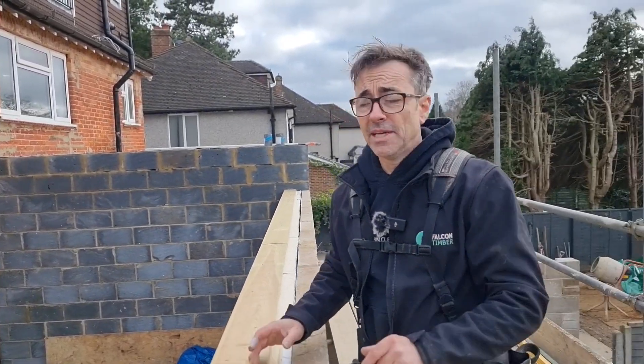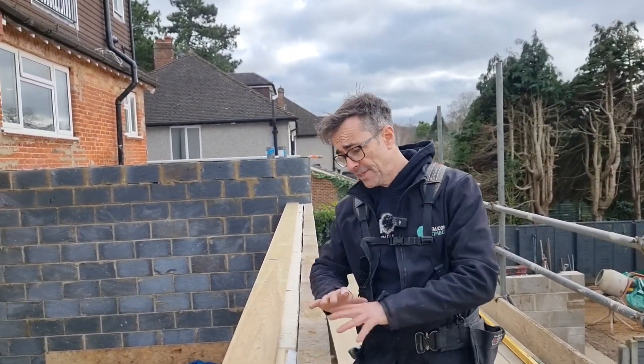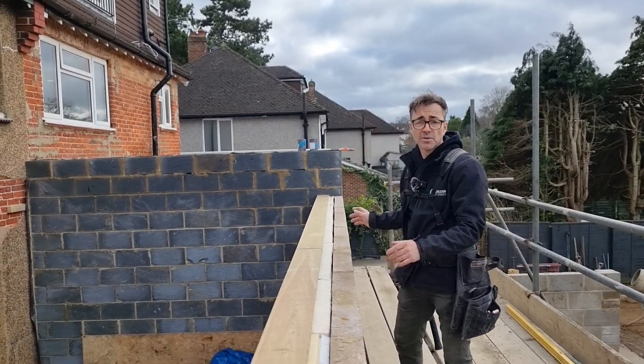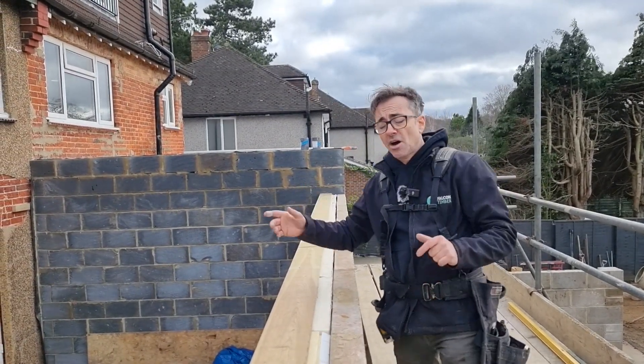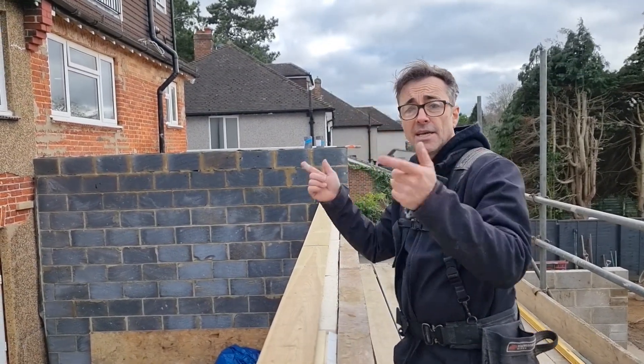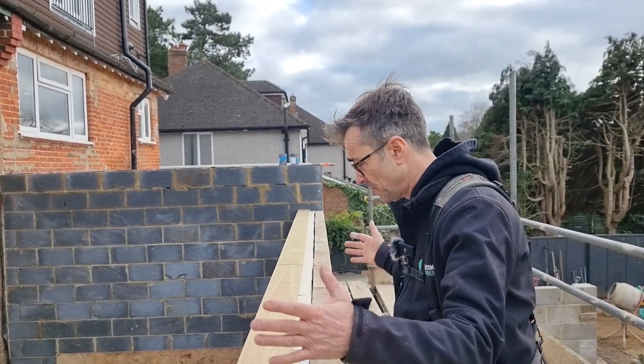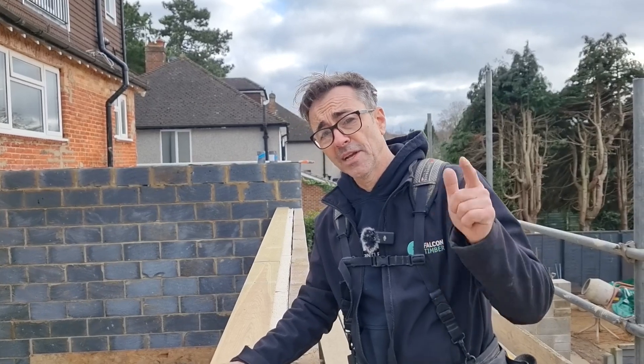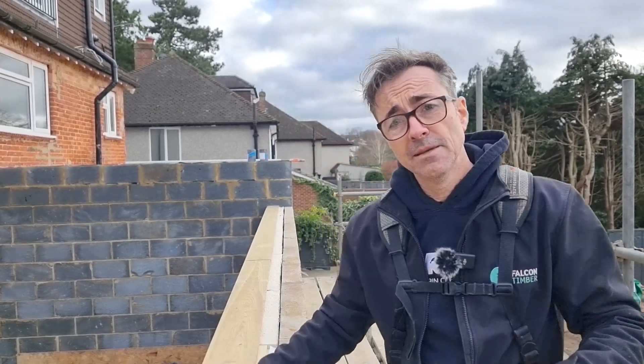What we do is cut the whole roof first — I've set the whole thing out. We've got a very big lantern in the middle which lines up with the doorway below. I've basically set the whole thing out and cut it down on the ground so I know how long the joists are, I know where everything's going. We've absolutely prepared everything, so I'm going to show you exactly what we've done downstairs with some of that timber.